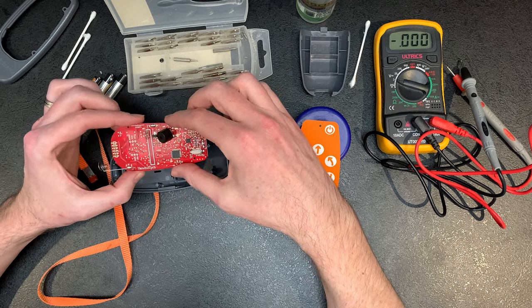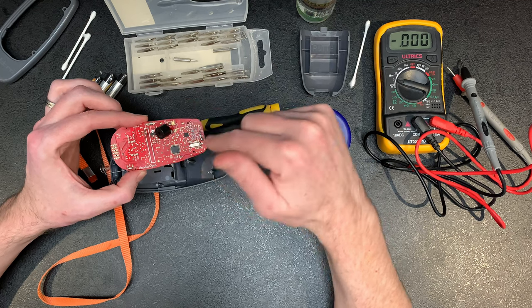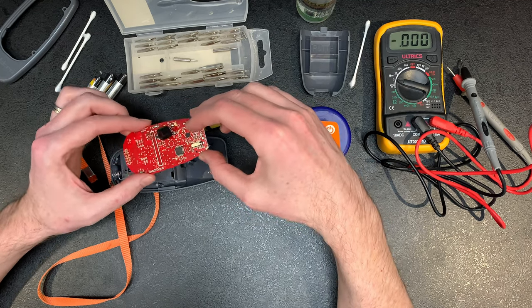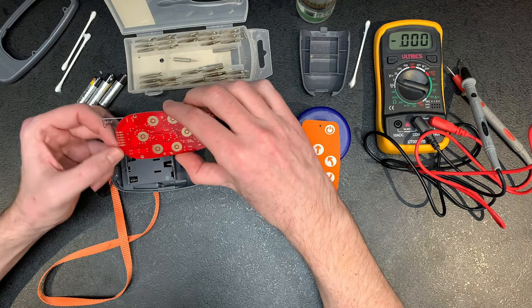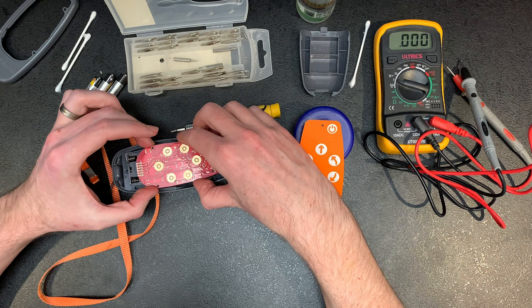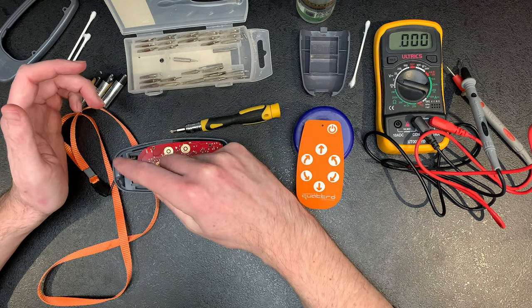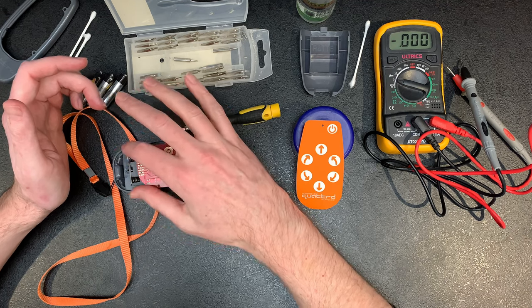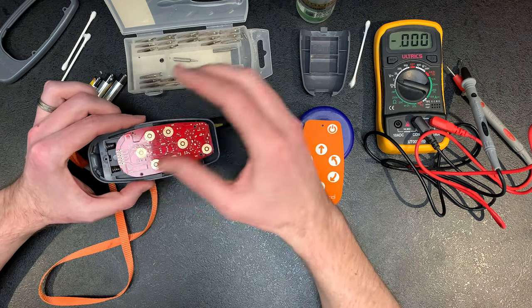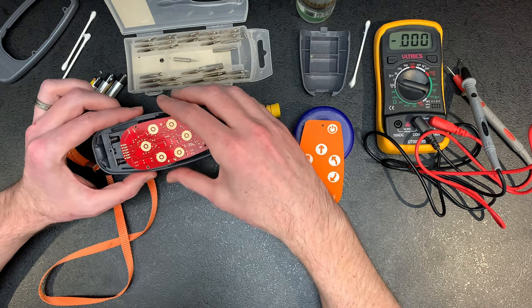And luckily for us, it wasn't that, it was just the water on the circuit here. So like I said, I cleaned it all up, and once I'd done that, I put some batteries back in, it did kick back into life. So if you've got any issues where it's completely dead, not responding, I'd say the easiest one is always to get a voltage here and see if that looks correct. And obviously swapping the batteries out, that's your basic steps for that.